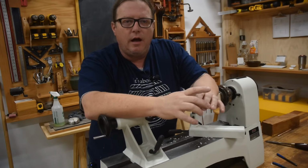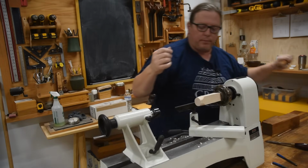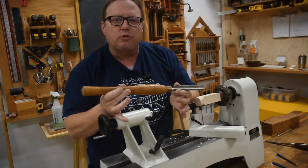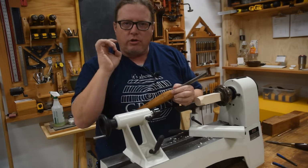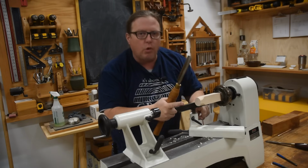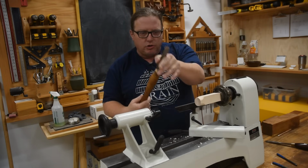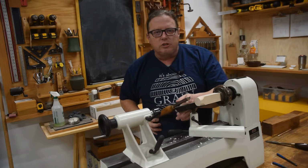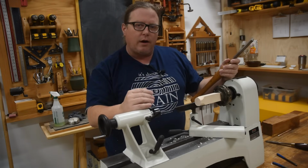Now, we covered all that stuff because I know that when you go out to the workshop and you turn on your lathe for the first time, you're probably going to be taking some kind of square stock and making it round. And that's what this tool is used for. And you will now be able to approach a situation not only knowing how the tool is made, its strengths, its weaknesses, but why you use the tool a certain way, why you engage the wood at a certain spot, why you put the tool rest at a certain height, why you stand a certain way and press what parts you are touching. The hand is on the tool, the hand is touching the tool rest for depth control, it is on your body so that you can make nice, smooth, controlled movements with the largest muscles in your body. Okay? You now should have the confidence to try it and do it successfully.